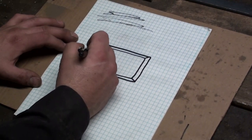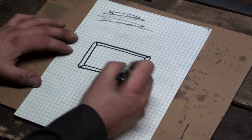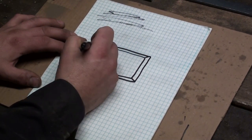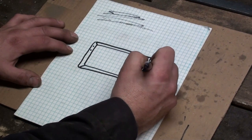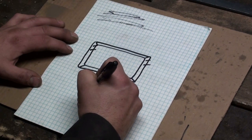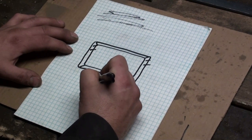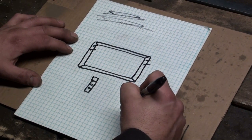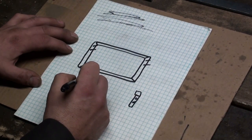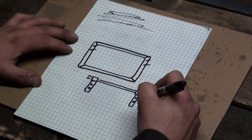And then, in particular, these pieces on the side, it looks to me like there's two bolt down points, two studs. So we're going to fabricate those studs. Then we're going to need to make a small piece that goes over top. That's going to have two holes in it. It's also going to have a hinge point for that bar. So we need two of those. We need to fabricate the bar that fits in between them. And then we'll start working on the latch.